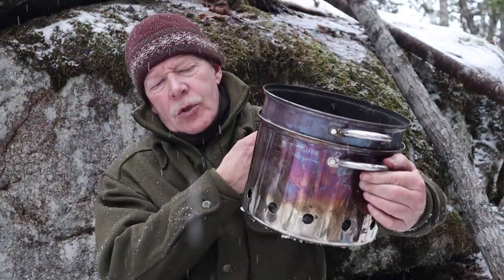First test of version two of the Supersize Hobo Stove — was it a success? Yes, with one qualification. It met almost all the objectives I had for it, with the exception that it didn't gasify — it didn't create pyrolysis. It's not a wood gas stove, but I didn't think it would be, because the ratio of air coming in from the bottom versus air coming into the fire chamber was off for true pyrolysis. That doesn't mean it wasn't a clean-burning stove. In fact, once it got started it was virtually smoke-free. It may not be a Solo Campfire, but it still works pretty darn good.